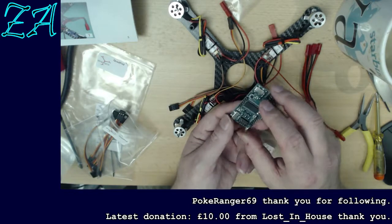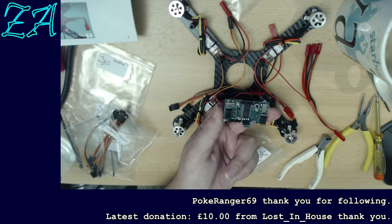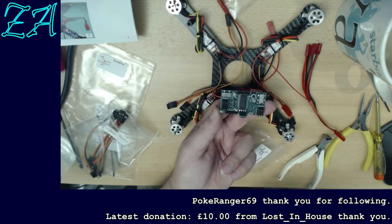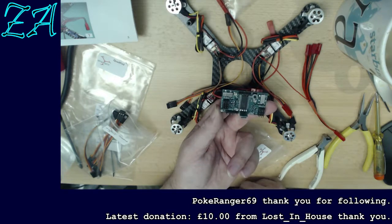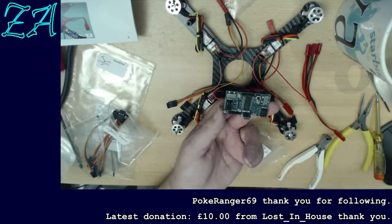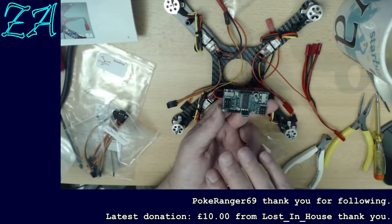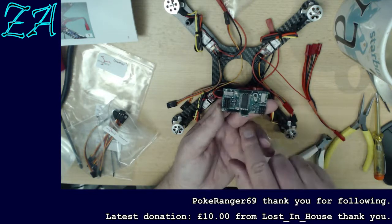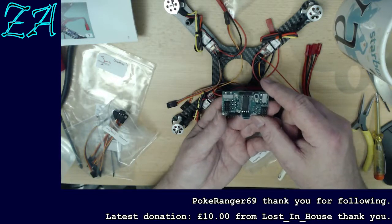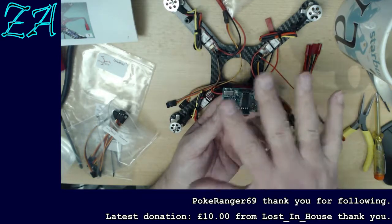And what you've got on here is, with quadcopters, the system which controls them is designed to be inherently stable. The things are so unstable that if you were to try, as a person, to control the four motors individually, it would be almost impossible for most people. So they build into it an inherent stability using electronic means, and this is the electronic means. It does two jobs. It stabilizes it so that, roughly speaking, it will hover.